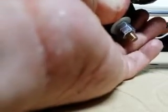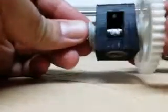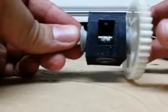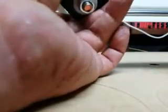Okay, so here we go on the other side, and like I said, we're going to do a couple of turns. Ready, set, go. That's 1 turn. That's 2 turns. Alright, so I guess because I'm filming the video and trying to keep everything in the field of view, I left a little bit of a ring down the middle that didn't get hobbed. That is not what you want to happen. So I'm going to concentrate a little bit more on it this time, and basically I just need to keep the bit straight while I'm hobbing, so that doesn't happen.